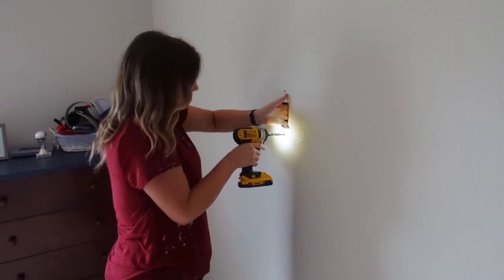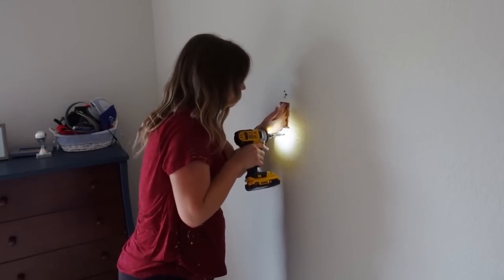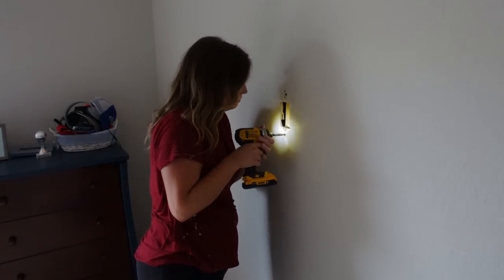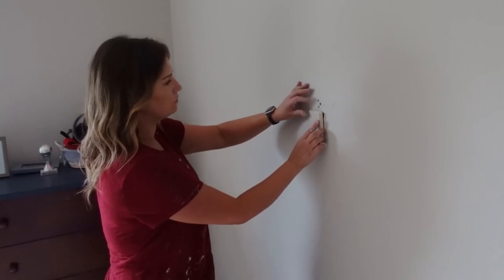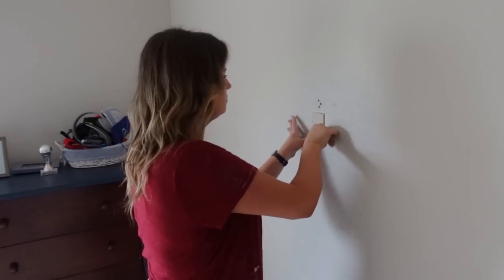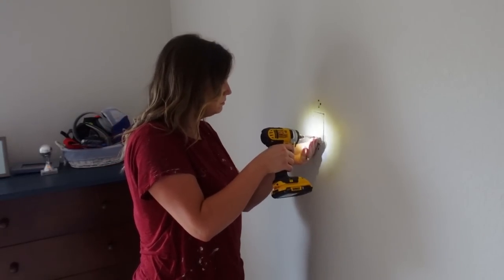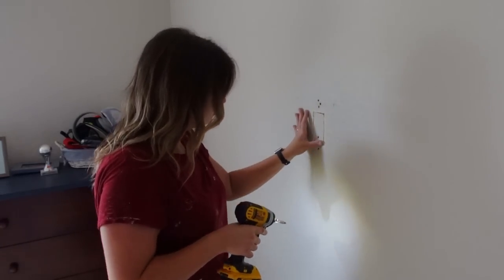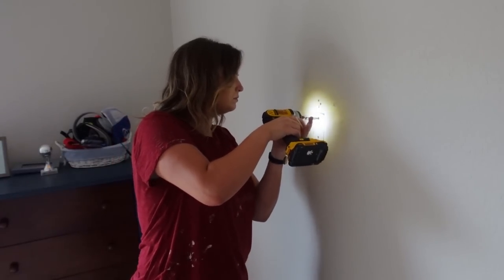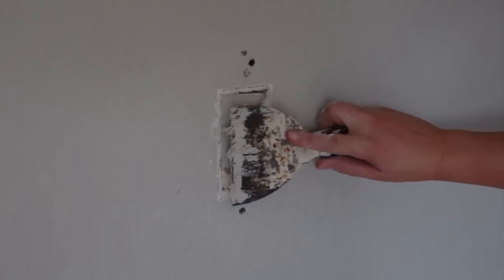And you guys have seen me do this before on my channel if you've seen previous videos. There were no studs that this was attached to. So I am basically creating a stud by putting some wood behind where I'm gonna put this drywall right here so I can screw the drywall to the wood. And then I will just go over it with some joint compound and then texture it, and it'll blend right in like it was never there.